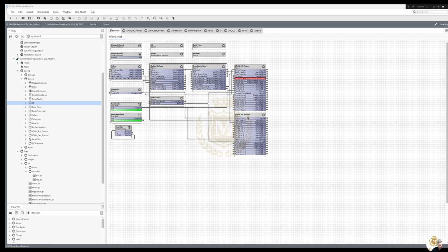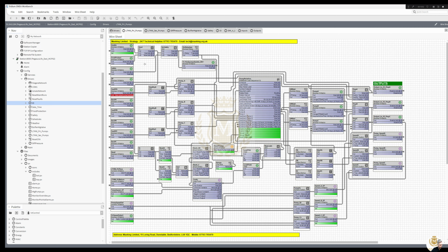They've got the LTHW primary pumps and they've got the secondary pumps. With the LTHW primary pumps, these are the ones for the loads. So I'm looking at that temperature, 64.6, and my set point's at 64. I'm at 50% at the moment, because I'm really close to set point, and the minimum that I've put is 50%, so it never goes down to zero. Minimum is 50. And at the moment, we've got a T-stat with a set point and a differential, which has given us a 1 there. We've got this one here with another T-stat with a set point and a differential, which has given us a 1 there. And then we always have a 1 in there, so we add it up and it's 3 loads.